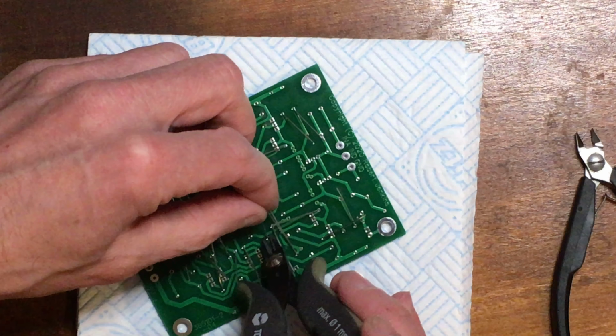The most important point is these are all flush cut. There's no bevel or angle on the underside of the jaws. That leaves a much more accurate cut rather than it being recessed into the blades. They're also much better for wire stripping if you pull that way on an insulated wire, as the flat side doesn't tend to slide out of the insulation. It gives a good grip.